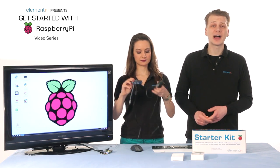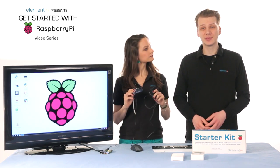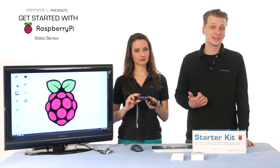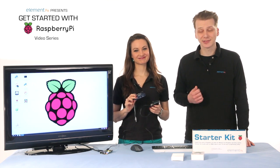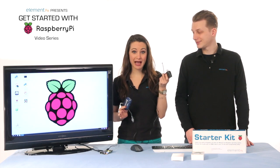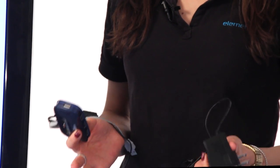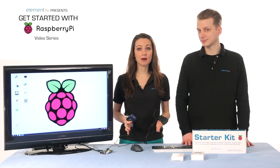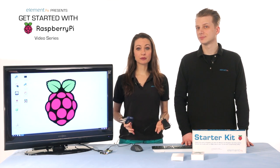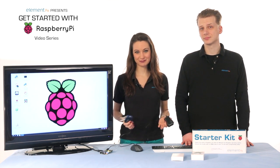Our Raspberry Pi Model B only has two USB ports. If you add an external USB hub like this one, you can have up to eight different USB devices connected to your Pi in addition to the hub. The most important thing to note is your USB hub has to be powered — there isn't enough power in the Pi to run a hub and the devices connected to it. Many USB devices will work with the Pi without the need for any special downloads or installs.